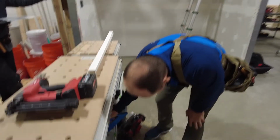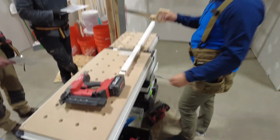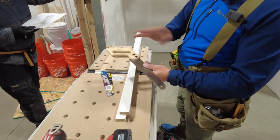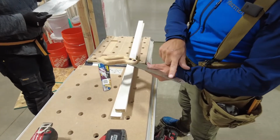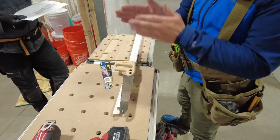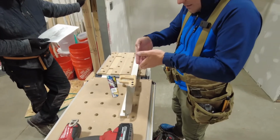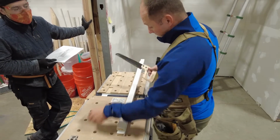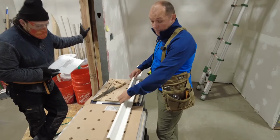So we have a little saw. It's a little shark tooth saw. This is a serrated saw. They're straight blades. Doesn't really matter. Japanese are pull saws, American are push saws. This is shark tooth. They're straight down, and the teeth are actually tapered, like this and like this, like the point of a knife. What that means is it's super sharp. What it also means is it dulls easily if you drop it.